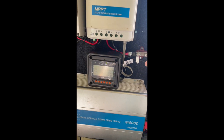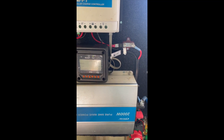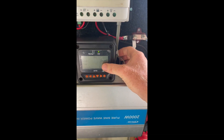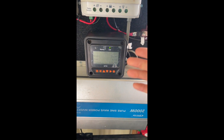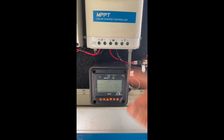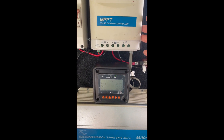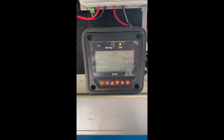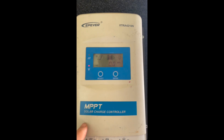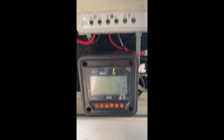In the upper section, the smallest cable I'm using is about 4 mm² with a 40 amp fuse. This other section here is just an MT50, which is an accessory to the charge controller. It gives a bit more information than the screen and allows you to change the charging parameters, since this is set up for LiFePO4 batteries. You need this to change the settings and set up a user profile for lithium. There's another whole video on that as well.